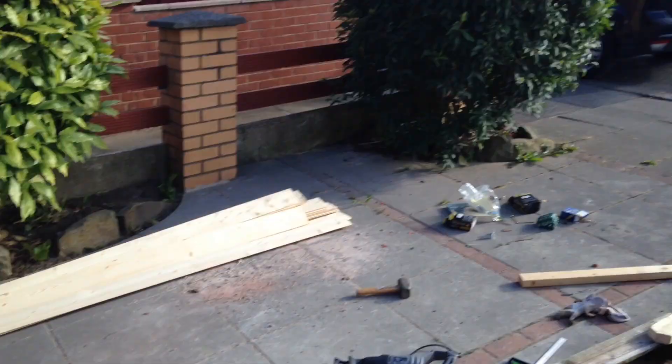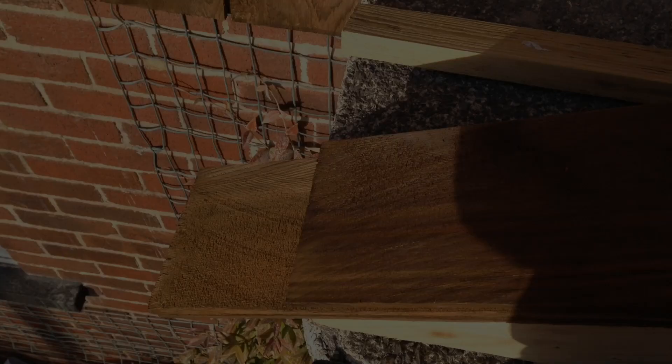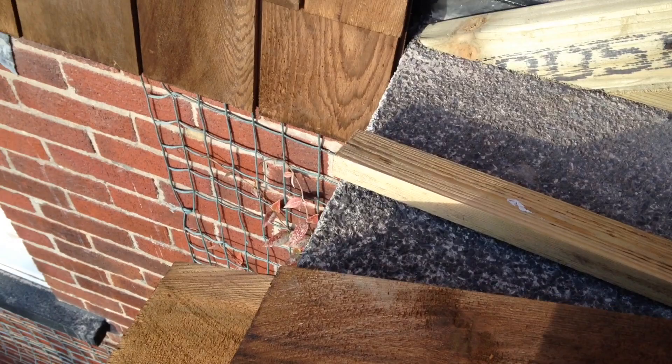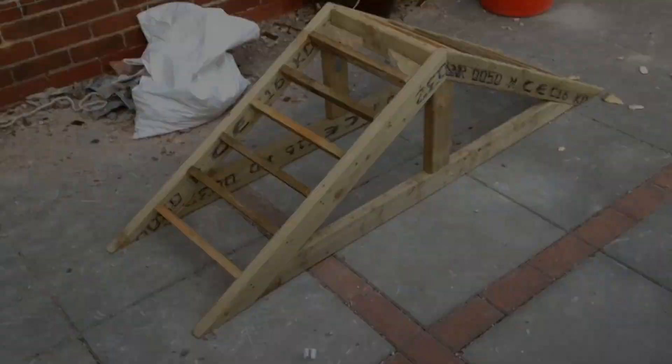The corners aren't particularly good looking but it doesn't matter — what does matter is that this roof is strong, because every winter we get winds around 100mph so it has to be strong. I don't want anything to blow off. I've just been working out the spacing on the shingles: I'm going to have 15cm between each row, positioning the first batten 20cm up from the bottom and then every 15cm as I run up. I've measured out the roofing battens and I'm now going to cut them to size.